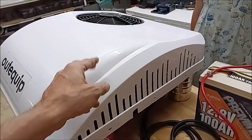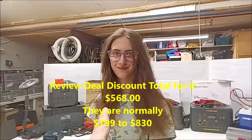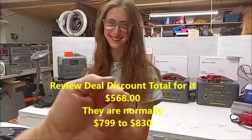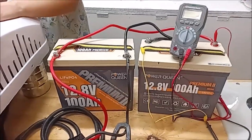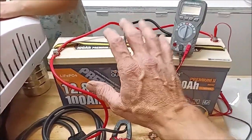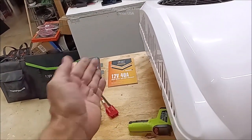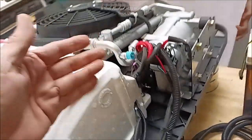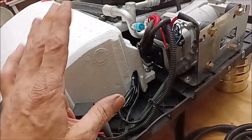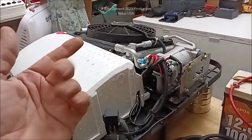We got this unit for about $750 with a $250 discount. These two Power Queens will be on sale — link below. A lot of these AC units have a built-in inverter, so you're getting tricked — it's not a real DC air conditioner. You'll pay $2,000–$2,500 but the compressor is not 12-volt. The inverter conversion efficiency is terrible; you might as well just buy an inverter separately.